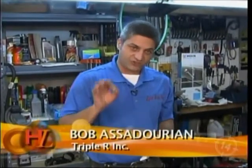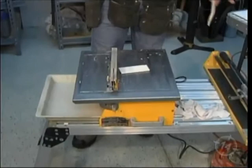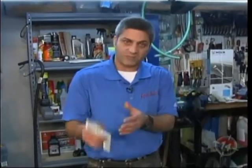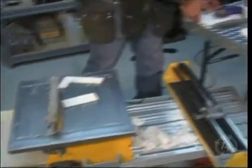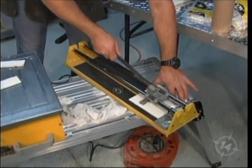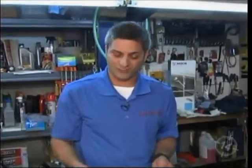Welcome back to the Just Ask Bob Show. If you're just tuning in, today we're working on a kitchen backsplash, teaching you exactly how to do it right. You just watched us using the wet saw. I really tell homeowners you need this. This can make L-cuts and a lot of nifty things. If you're on a tight budget and it's a one-time job, you can rent these tools — almost every tool shown here, with the exception of a putty knife, you can rent at your local big box stores. A cheap sliding tile cutter can be had for 20 to 30 dollars, but they're pretty useless — all they can do is a straight, forward cut with a snap. Since every room has at least one electrical outlet, you really do need the wet saw.